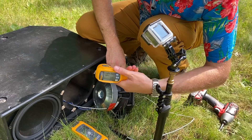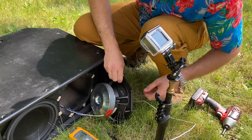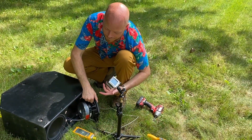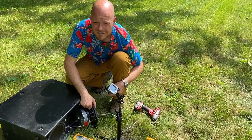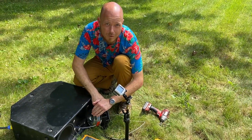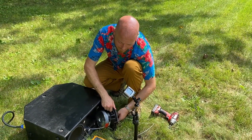This is the problem with trying to tell this stuff. I can touch it, so it's not too hot yet. I'll put this thing back together, start it back up, and take the limiter from — what do we have now, Chris? 60 watts. So we'll try 80 and see how hot it gets. Now that it's a little bit warm I'm not worried about putting a little more power into it, because it's already soaked up some heat so it's not going to get hurt if we beat it up a little bit more.